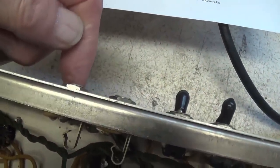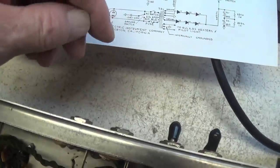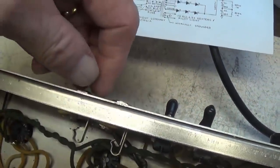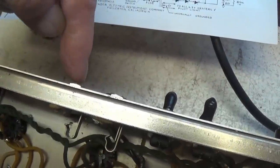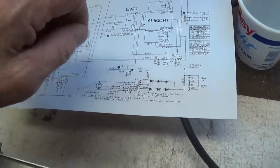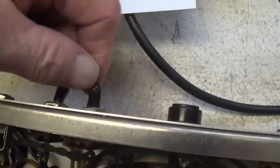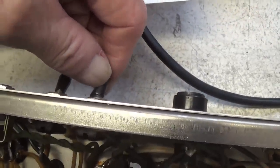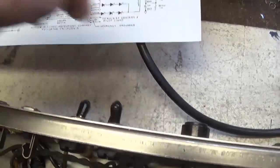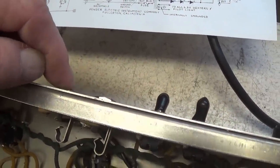The one thing they didn't think of, though, is that if you have a shielded input from a cable from a guitar plugged in, the guitar strings and all the metal parts of the guitar are charged just the same as the metal chassis, because the shielding carries the charge from the chassis right up to all the metal parts in the guitar. So yes, you've got your lovely little protection here, and you can just stand in that bathtub and flip your switches all you want, but God help you if you touch the guitar strings while it's plugged in.